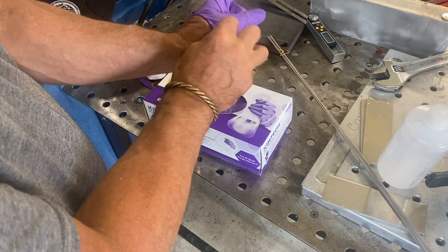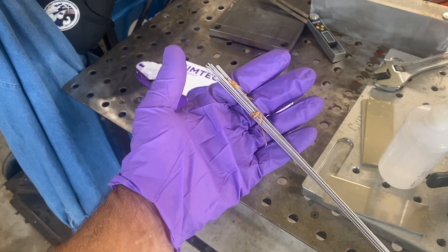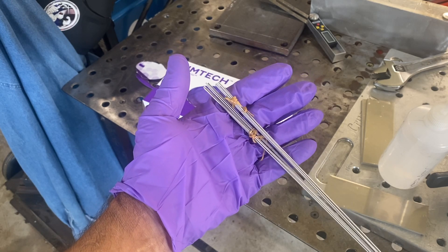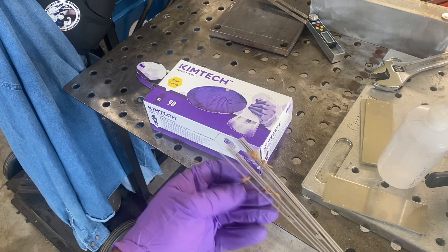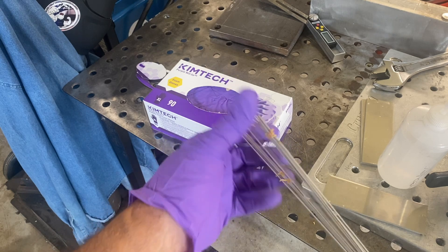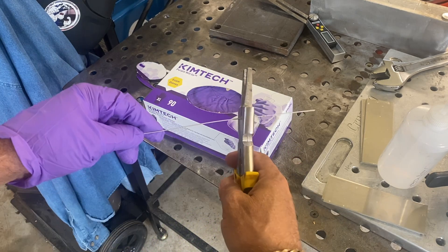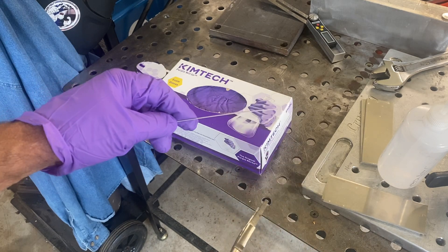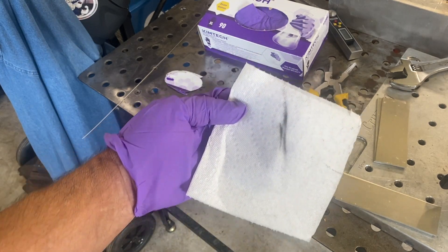I'm going to clean the filler wire — and check this out, this is a problem. This filler wire came to me ordered online with rubber bands on it. That is a horrible idea, especially for titanium filler metal, because over time it bonds itself to the wire and it's hard to get all that gum off. So I'm just going to snip off the piece I'm using rather than waste time wiping it clean — I'd rather waste a few inches of titanium rod.